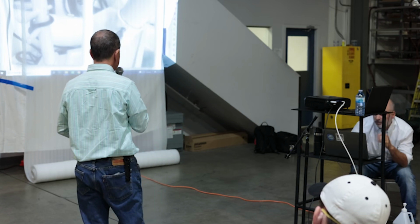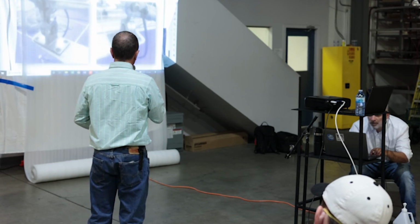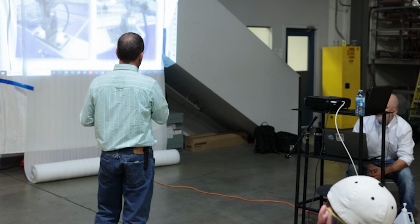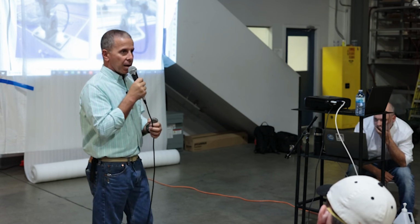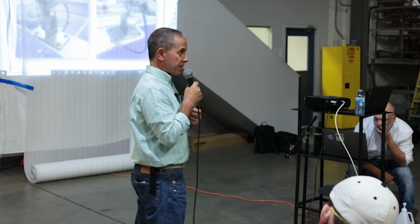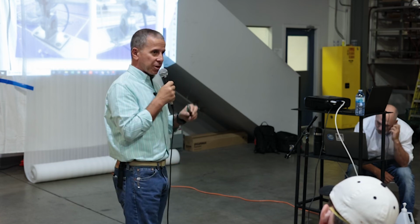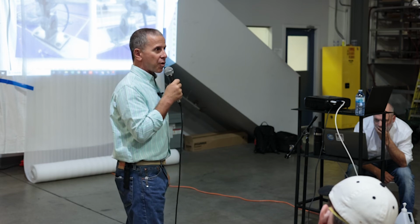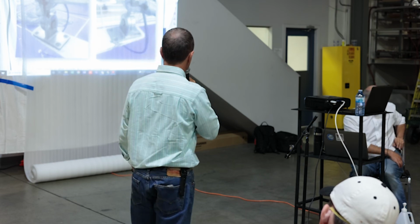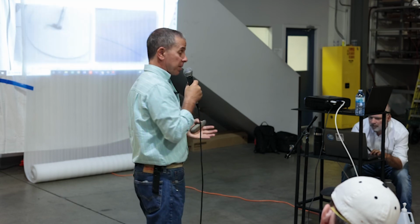Let me see what else is on. Yep. So again, a piece of hardware that is attached to a painted aluminum surface, those fasteners are cranked down good and tight as they need to be, and the minute you do that, you're fracturing paint, especially around where those fasteners are compressing that stainless steel base against the painted surface. You're putting a crack in that paint, a breach, and water penetrating beneath that causes that type of failure.